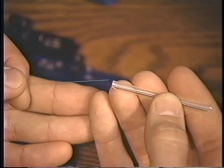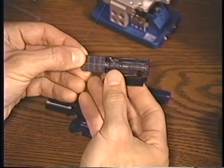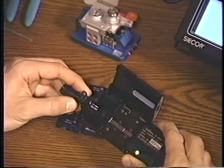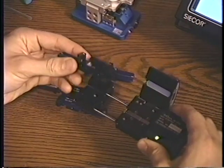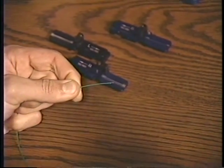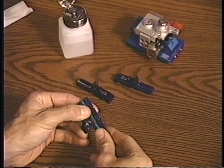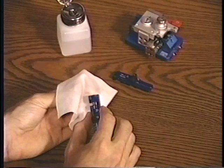If you wish to splice single fibers, slip a heat shrink over the fiber and slide it out of the way. Select the correct handler and clamp as shown. Then, remove the coating. If splicing 900 micron fiber, remove about 2 inches of coating and place it in the handler. Then clean and cleave the fiber as you did for the ribbon. Repeat these steps for the other fiber and handler.